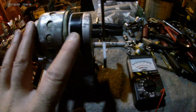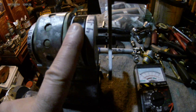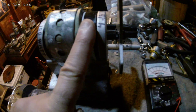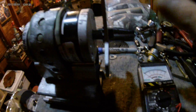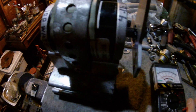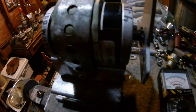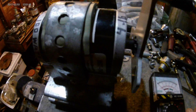The motor for this is a permanent magnet motor, of course — that's what you want to use. This particular one is a scooter motor, and it came with a gear head that's threaded on it, which was really useful for attaching this crank. This particular motor is 24 volt direct current, 100 watt, which works out to about 4.16 amps. This could conceivably even jumpstart a car — it's powerful enough.